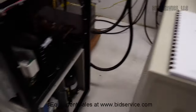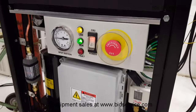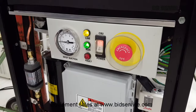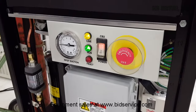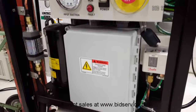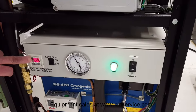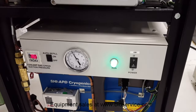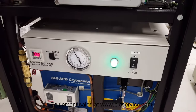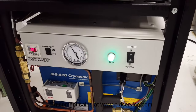The controls are very easy to operate. There are three. There is a main breaker here that turns on the refrigeration compressor, which will come on after a time delay of approximately two minutes. The bottom controls operate the auto-fill — you can set this to a particular range to keep the constant pressure of your cooling gas in the system. This breaker here controls the actual gas compressor itself.